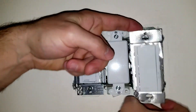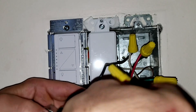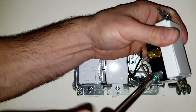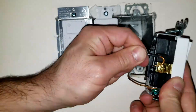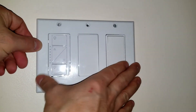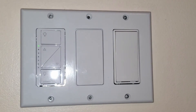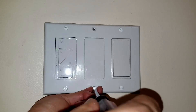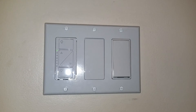This switch circuit setup is no longer up to code. I'm going to fast-forward and replace the other switch that's not working — the installation is the same way. It's a switch loop, so another white and black configured the same: black to black, black to white, green to bare copper. We have this installed — it's very simple and easy. I turned the power on and the light on the Caseta went on, showing it's working. Now I'll put the screws back on the plate and set up the hub.